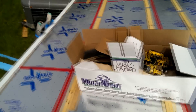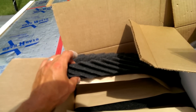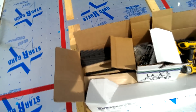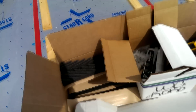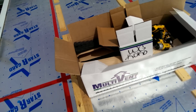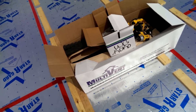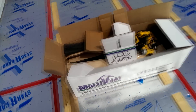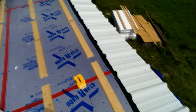Just so you can see the strips I'm using — it's called multi-vent closures. They just conform to whatever your panel might be, so they can go above the panel or below it and smush down to whatever. I don't really like them — you've got to use more screws along the edge to keep it down because it pushes the panel up. You might want to look at some other products, but this is all that was available to me locally for the vented closure. They do have non-vented closures that conform to the R-panel shape, but I don't like those either. We want this roof vented at least somewhat so it can cool down easier, which is also why we're going with white — so it doesn't hold onto heat as much.